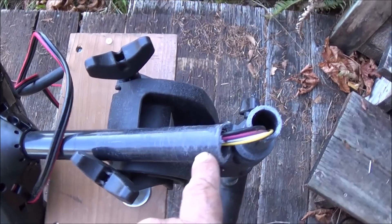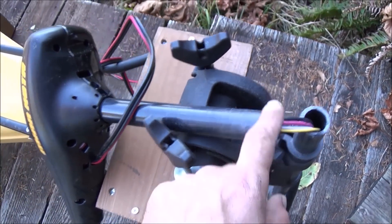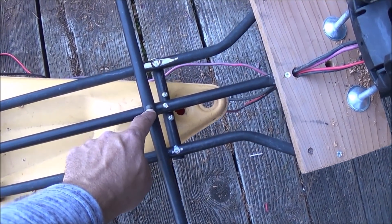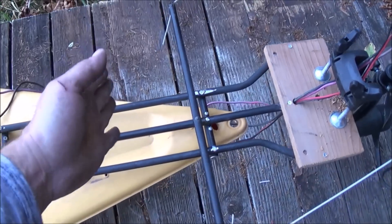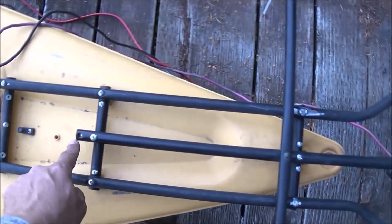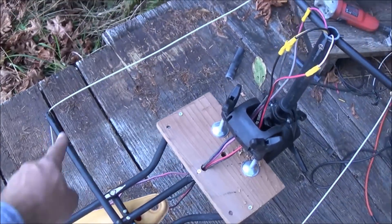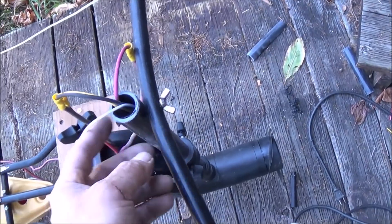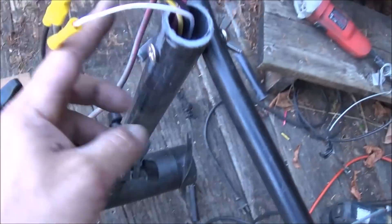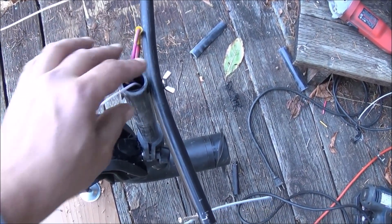Here's what it looks like inside the shaft — I've just separated it. You can see there are four wires, and all we're going to do is extend the length of all these wires. I've finished some of the steering linkage pieces. Right here is a crisscross piece with the original pivot rivet still in it from the chair. I've mounted one length of that down onto the frame we built, and the part that was loose on the rivet we've got as our steering arm. That goes with cables up to an arm where I've drilled a hole through the original column going down the electric trolling motor — you can see a wing nut and bolt put through there. I've bent the arm slightly with an arc going backwards, which will increase our steering radius just a little bit.